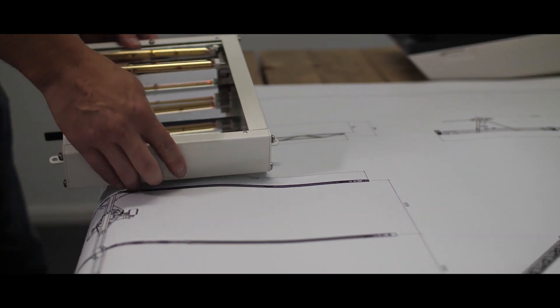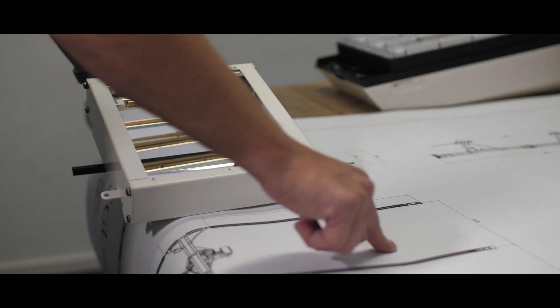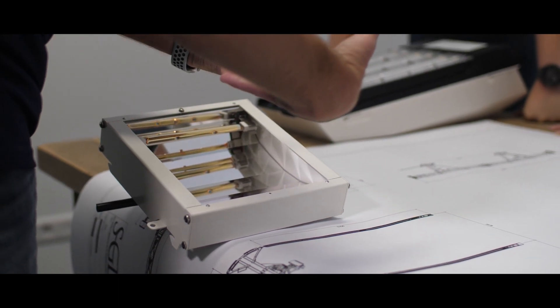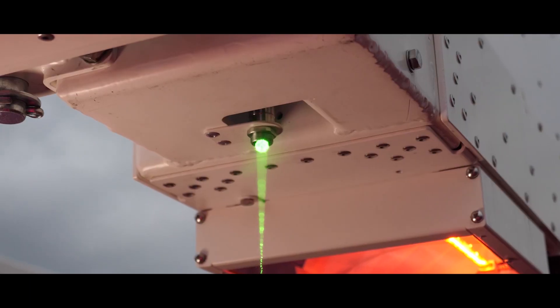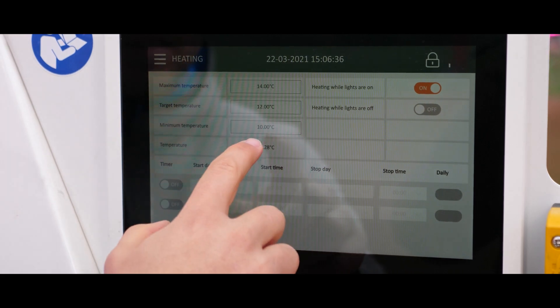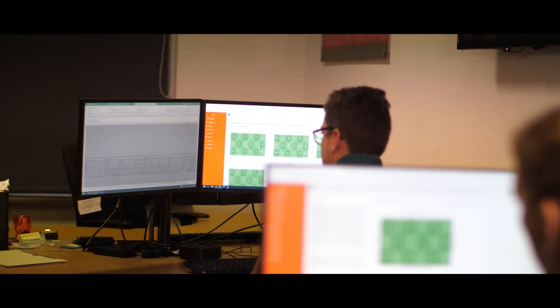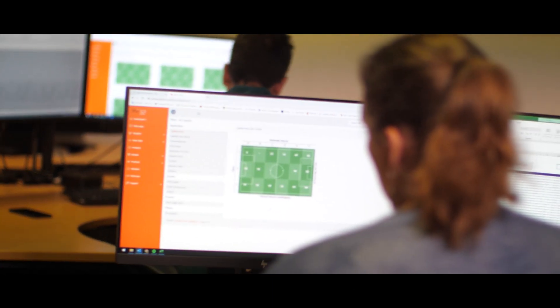We did a very unique layout of those fixtures to give us a very high uniformity of heat. To control the LED 440's infrared array, we placed sensors on the system that actually monitor the temperature of the grass. From there, our control system — which was also custom built for this unit — monitors and regulates the amount of heat delivered to the pitch so that the customer can dial in exactly what is suggested by our assist team.